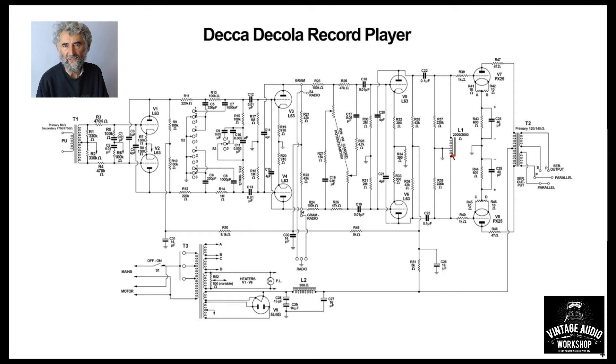As a further aid to balancing the circuit without adjustable resistors, they use a transformer — actually an auto-transformer. If these inputs are perfectly balanced and opposite, the transformer is effectively invisible from side to side. But any imbalance in signal level or phase causes induction of a signal on the other winding, loading the other side in mirror image. This is a balancing arrangement — rather an expensive one. A variable resistor would have done it far more cheaply and without the problems with inductors: leakage inductance, risk of picking up hum, core saturation, and non-linearity causing distortion.